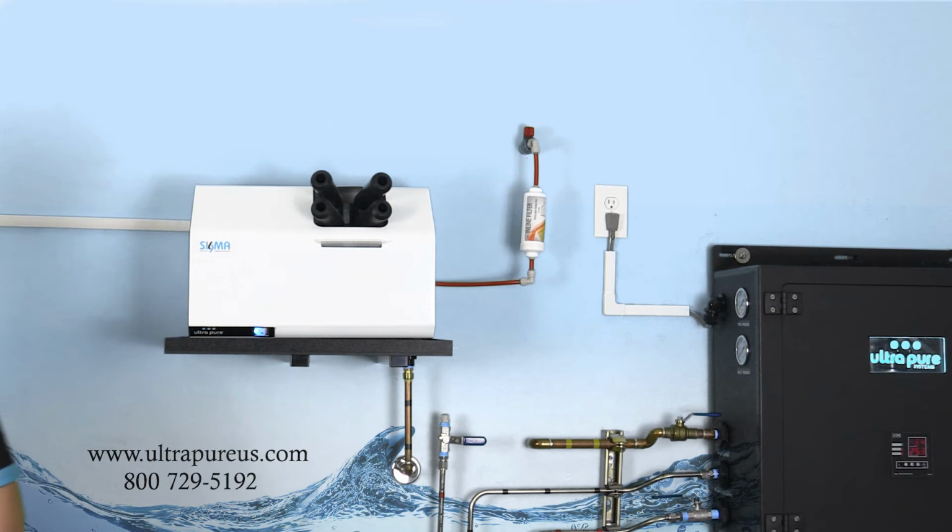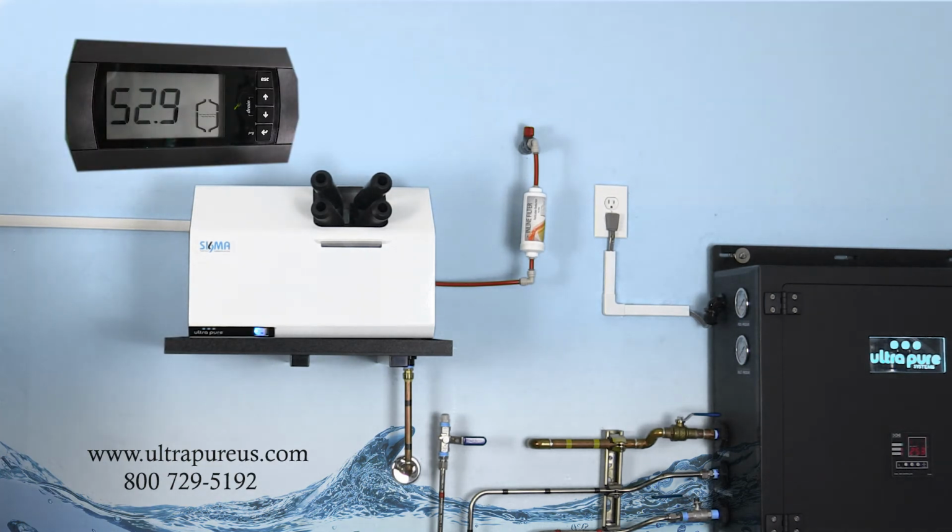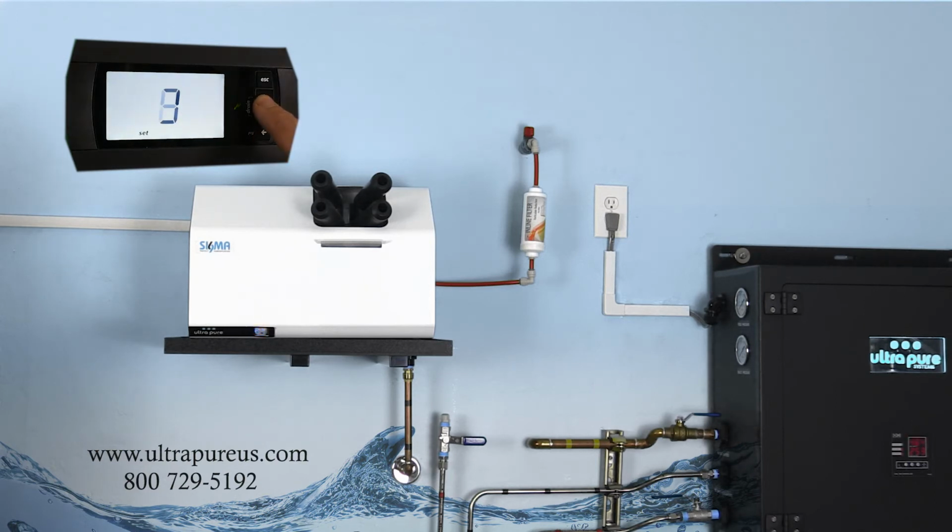It's very easy. From the factory, we set these with relative humidity. If you would like to read dew point, as you can see this is reading RH, all you're going to have to do is push the program button. You're going to want to go up to 7.7. The first parameter is AO. You're going to want to push program one more time and go up to number 4. Push program one more time, and that's all there is to it.